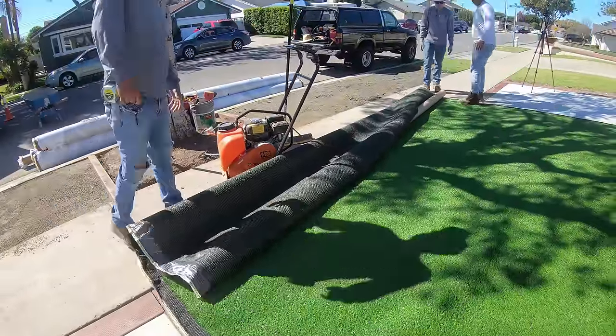As you can see, that's what we are doing right here. And then once the nails are all the way at the bottom, we like to just move the blades around, try to feel it out, see if we have any blades caught by the nail head. But that's how we do every single one. We usually have one guy dedicated to putting the nails in, sometimes two, depending on how big the area really is. But you can see all the nails that we have in this artificial turf already.